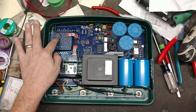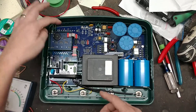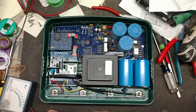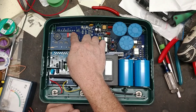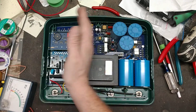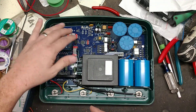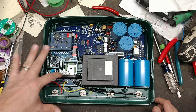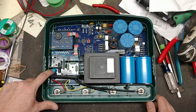This is your LCD board that shows the numbers on the front — voltages and such. The red and green lights that light up and flash across the front are surface-mounted LEDs soldered up here. They're tied together with a ribbon cable so the lights and the numbers work together. If the lights don't go all the way into the green but fall to the middle, the number will also drop — say from 10 kV down to maybe 5 kV depending on your load.